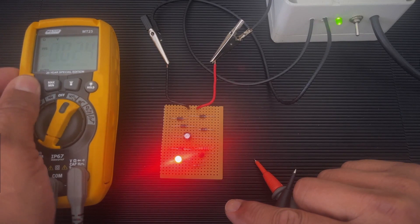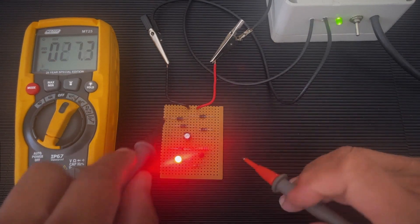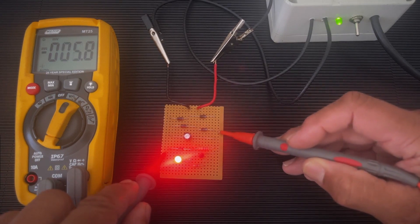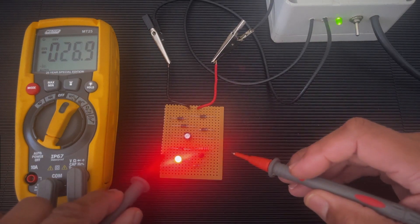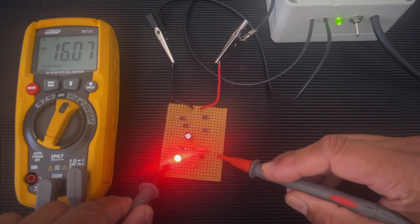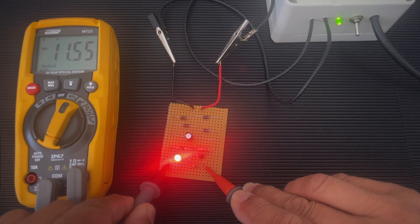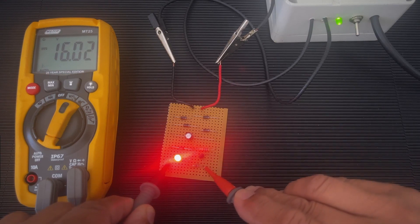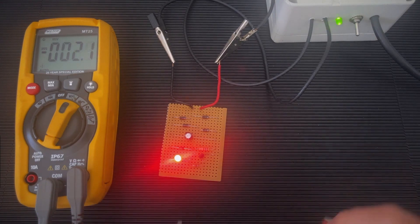I select DC, which is what I want to measure. I'm putting an AC supply in but I'm getting DC out — it is a regulated power supply, so more than one voltage. I've got my black test lead on negative, and we are looking to test point A which is four points on top, but I'll just go straight to my collector and then test point B. You can see there are two values: the first value was around 16 volts, and the second value was around 11 to 12 volts.